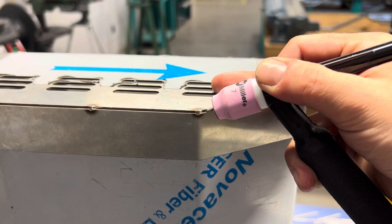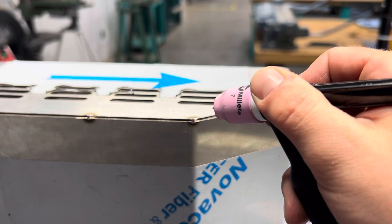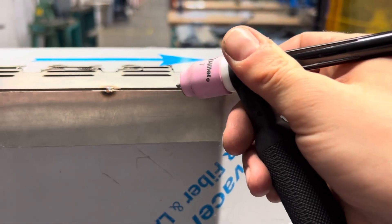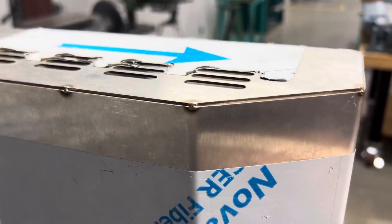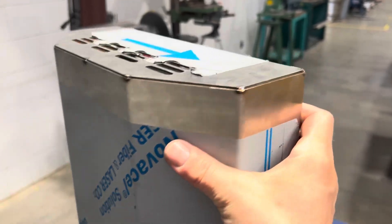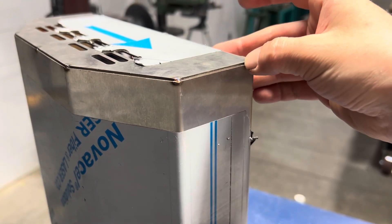Make sure you're resting that cup so you're nice and stable. You don't want to be out in the middle of nowhere with the coffee jitters. Just nice and stable — tack, tack, tack. And I know I need to put more tacks on this, as I mentioned to my class on Friday. Aim for about every half inch.